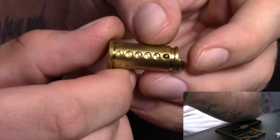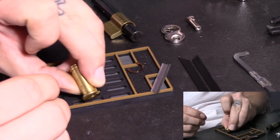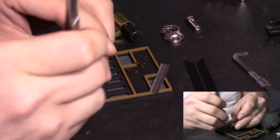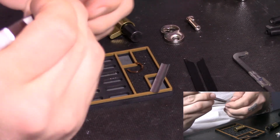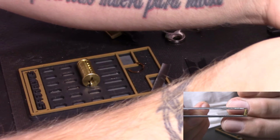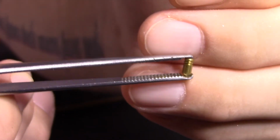Let's show this camera view so you can see the empty hole back there and you can see our 5 pins. Let's go ahead and see what our key pins contain, see if any of them have serrations on them, which they better. Yep. Okay. Let me go ahead and show you what this is just in case you don't know. That way when I say whatever, because some of the lower cut sizes, they don't have serrations on them. So there is a serrated key pin. And show the high def camera, and that is serrations on our key pin.